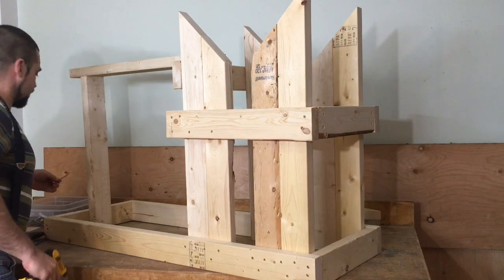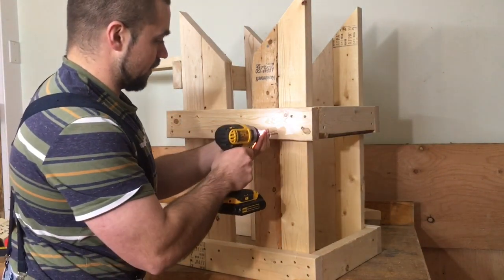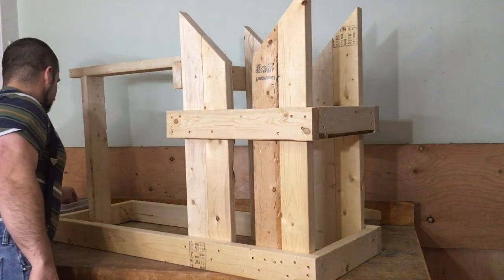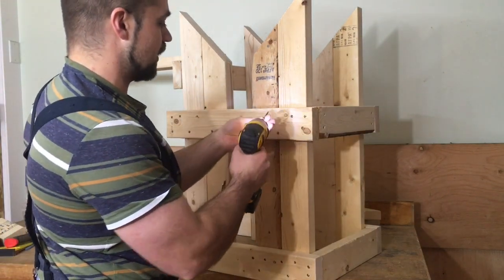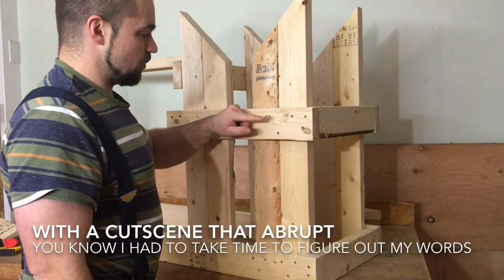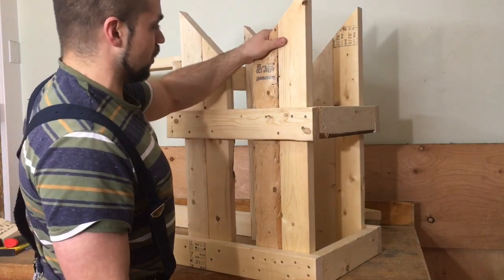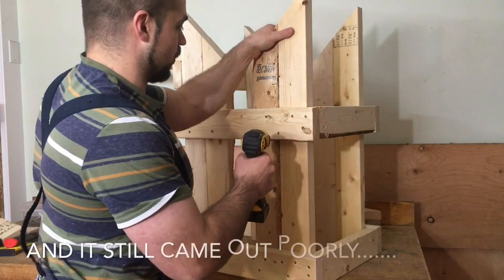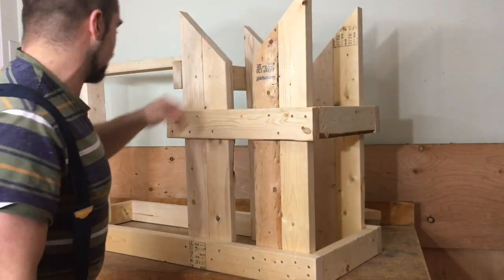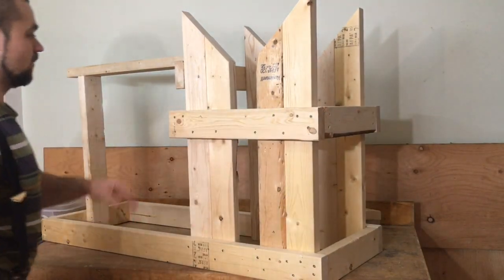I want to explain one little thing I'm doing here. This guy over here is already good and tight in the corner, so we can just screw her down. But this guy's still got a little bit of a gap, so I'm going to pull it over with my hand. My first screw that I'm going to set I'm going to aim towards it, so when it meets the smooth part of the shank of the screw, the surface area of the head of the screw is going to lock into this board while the threads are still pulling further in. It'll help pull it right over towards this board. So I'm going to pull it over tight by hand first so it's snug, and then it'll just finish clamping it in. I could feel it just tighten right up, and then this next screw I'll just go straight back in at 90 degrees. So their braces are all around now.